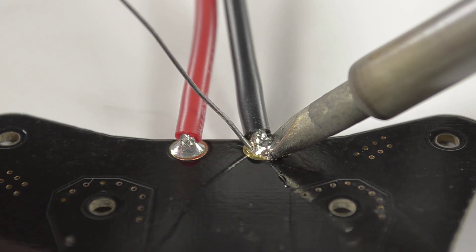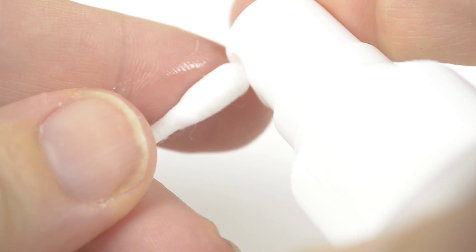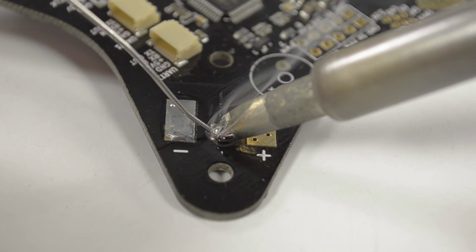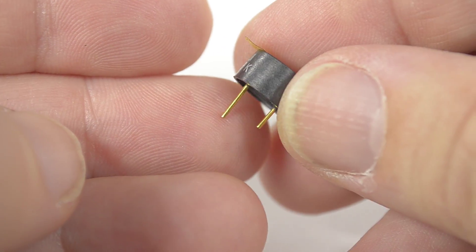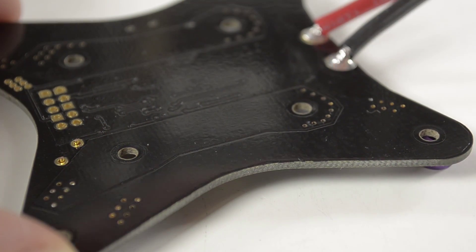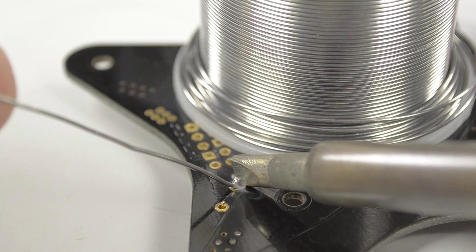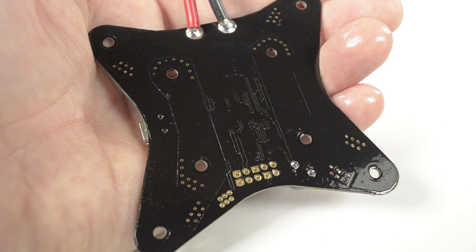Turn the board over to finish off. Put some isopropyl on an earbud and clean up. Tin all the ESC and signal pads. This is the slightly lower profile buzzer that comes with the Moto Frame Kit, also available separately on Impulse RC. The long pin is the anode, also marked with a positive — I like to cut them off flush. Use two of the five and a half mil spacers to prop the edges of the board, then weight down the board on top of the buzzer for soldering. And solder. Remove the protective cap from the buzzer.